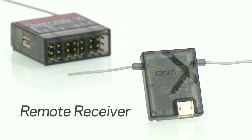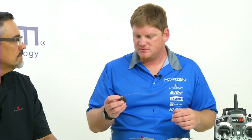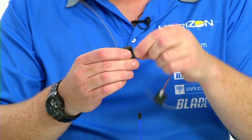The AR7700 can work with or without the included remote receiver, which gives you flexibility. If you're flying a small course with a quad racer, you're never going to have a problem with range, and you can keep weight as stripped down as possible - use the coax style antenna to get it in an optimal position without necessarily needing the diversity. If you're flying a mid-size or prosumer quadcopter, hexacopter, octa, whatever, and you want diversity with full range performance, then you're going to want to use the included remote.